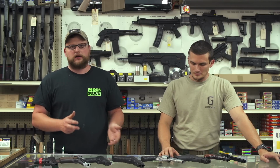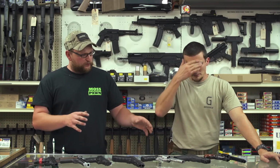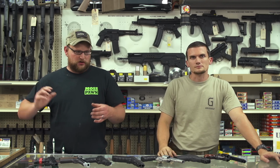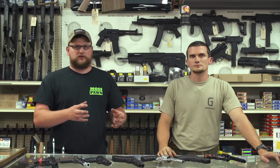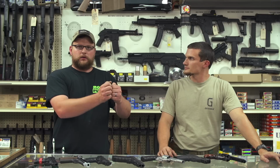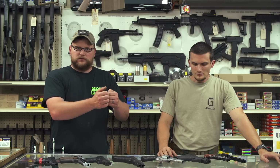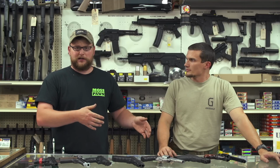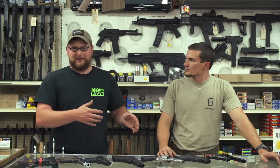You want to really avoid allowing those surfaces to just slam with the full force that the recoil spring allows. Those forces are designed to allow the gun to function. It's to allow the gun to strip a round off the magazine into the chamber, and of course that pressure also allows the extractor to overcome the rim of the case to hold on. So all of those forces are basically calibrated to allow the gun to function, not to allow the gun to just slam.